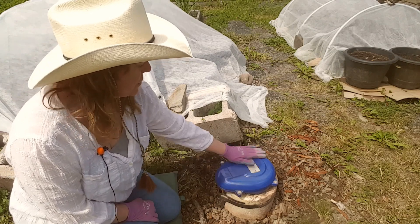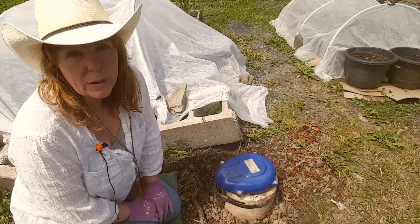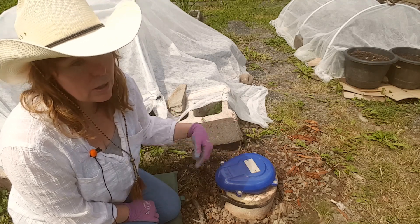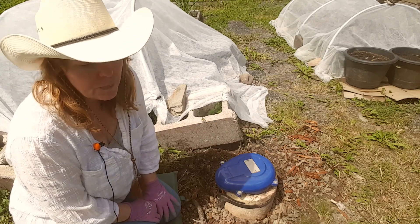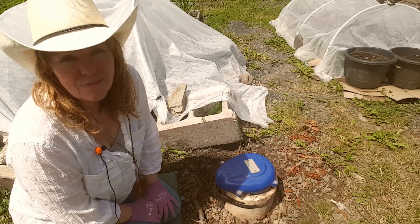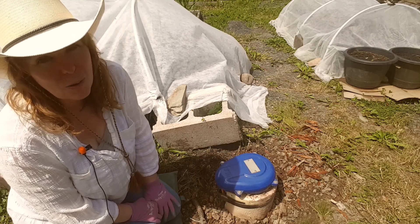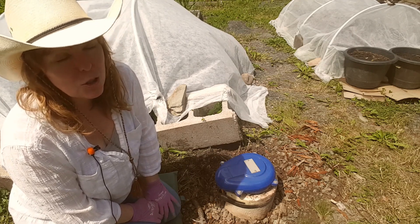This is my well cap. I'm going to be opening this up, pouring in three gallons of bleach, and then I'm going to run a hose into the well itself so that it will circulate water for about four hours, and that's hopefully going to flush out any bacteria that's in there. After I circulate the water, I have to let the water run for a good half hour to an hour at odd times for the next week or so to try to get all that bleach out of the water. Hopefully that'll take care of the bacteria — I'll know because the water should be clear.